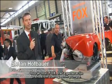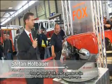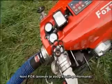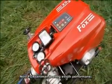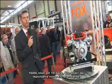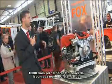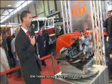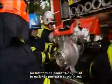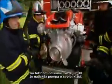Here we see the new FOX, the third generation of the FOX portable fire pump. The new FOX scores most of all for its outstanding pump performance of 1,600 liters per minute at 10 bar, which means that it fulfills the new European standard EN14466 for type 1500 at 10 bar. Also weighing only 167 kilograms, the FOX is by far the lightest portable fire pump.